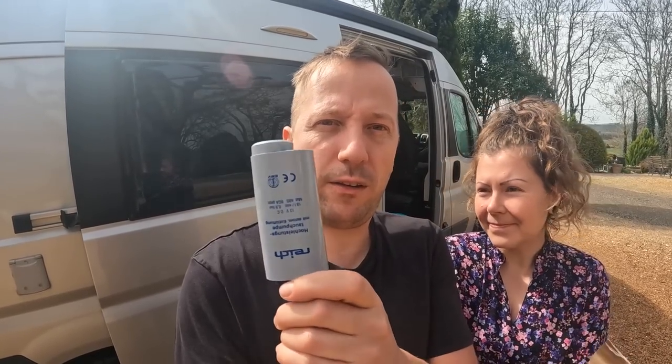And if your pump is stuck after winter, there is one thing you can do. There's a filter. You take the filter out, and there are these plates inside. Sometimes the axle of the pump gets stuck. Roll the plates a couple of rounds and it works again, so you don't have to actually buy a new pump.